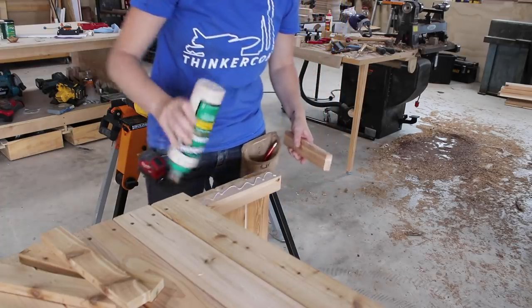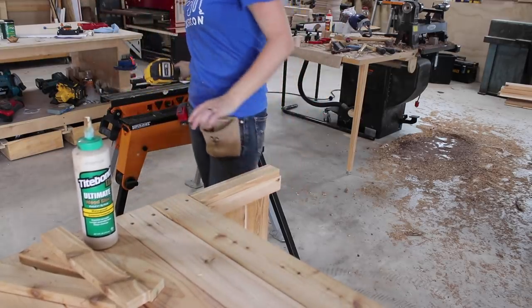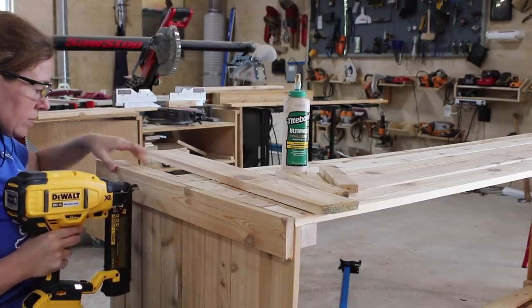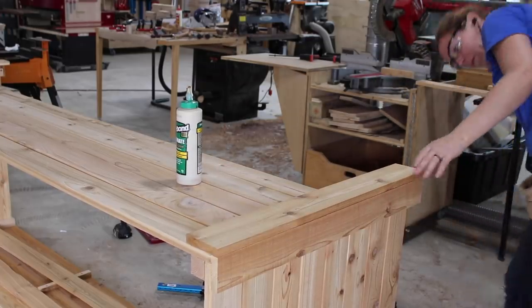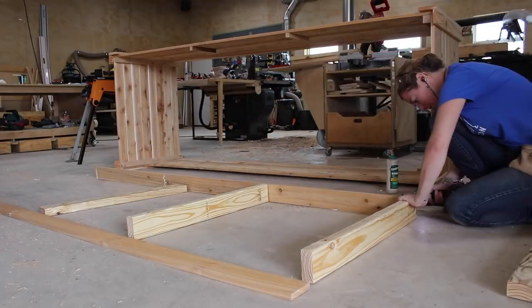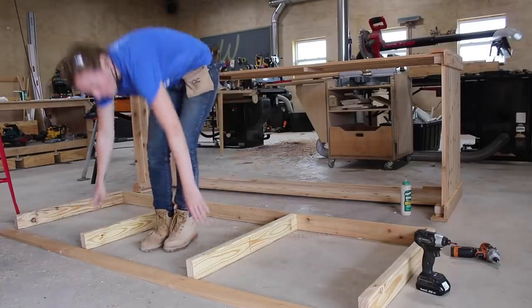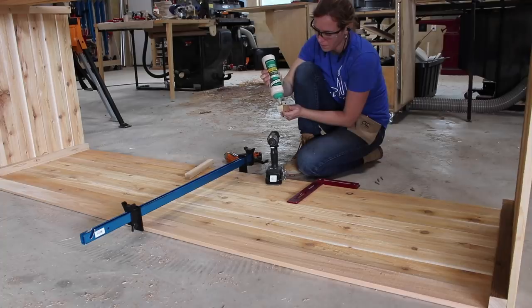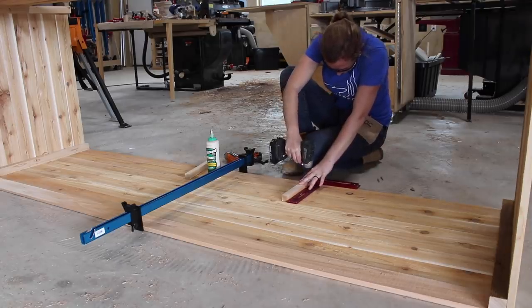Next was adding the trim to the corners. I first attached some scraps to build up the post on the drawer area so everything would be on the same level, then cut the boards to length, laid down glue, and nailed them in place. I went with nails here to avoid screw heads being shown. These trim boards also double as four legs for the planter. I then set up a new work area to assemble a simple framing structure that will allow me to add a deck as well as drawers, taking measurements of the inside and cutting some 1x4s and 2x4s to length. Take your time to get these framing members spaced evenly and squarely, because they dictate the size of your drawers later on.